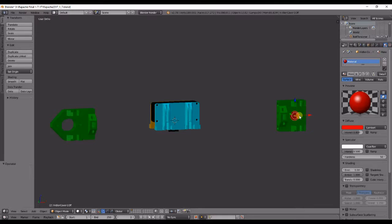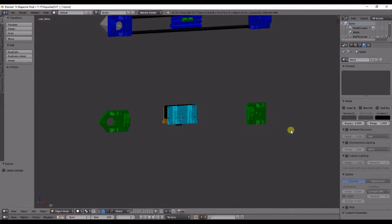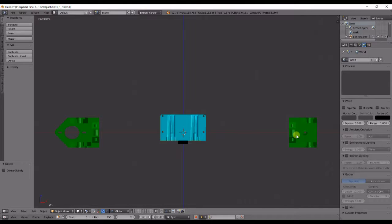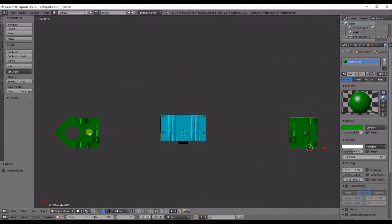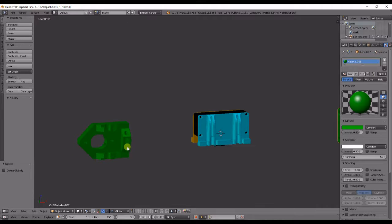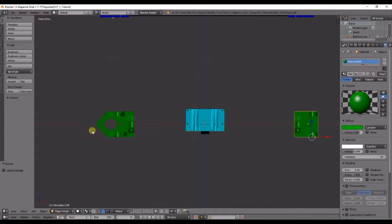I reused the same basic shape of this box right here, so that cover didn't have to be modified at all. So I just reused it as it is. Basically, all I did was flip the smooth rod bracket and the threaded rod bracket where your nut gets recessed in there. All I did was flip those around and move that motor mount over on those.